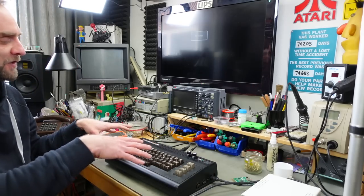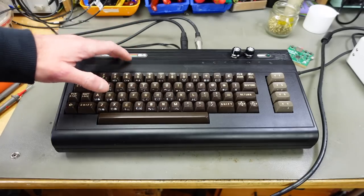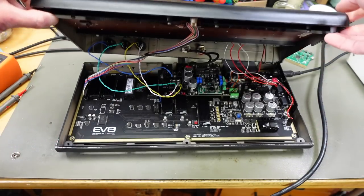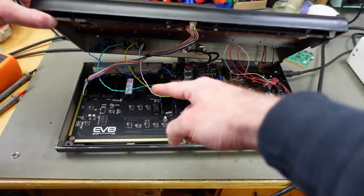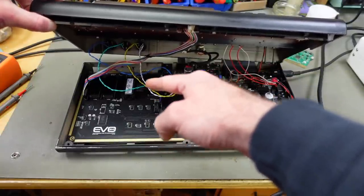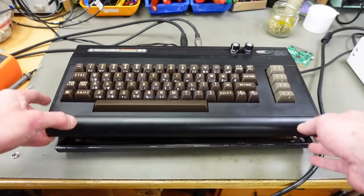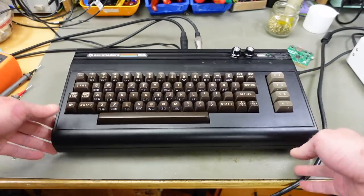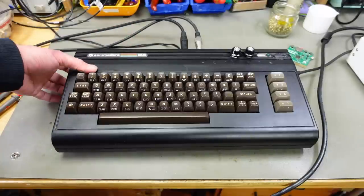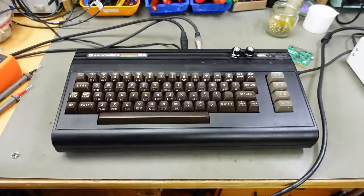So we're going to focus on the Cynthcart, and we should be able to program the EPROM that is currently in here in a way so that we can add the Cynthcart image to that, the binary, in the correct spot. So the first cartridge image on this should be the Cynthcart, and then we should be able to start that up with flipping our switch here. Currently, it just starts up with an empty cartridge image, I think. Not sure what's on that EPROM, that's just the test EPROM.